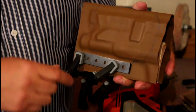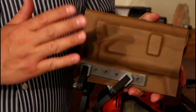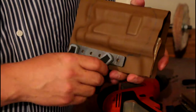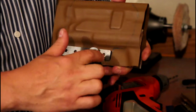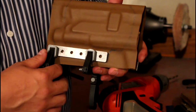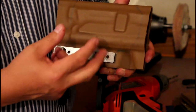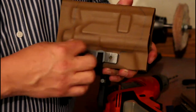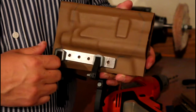We've got our drill guide in place with a half-inch block of wood clamped in there from making my pattern for the tension points. I'm only putting screws and holes every inch and a half, so there'll be one here, here, and here — three tension points. After that I'll get my half-inch rubber spacers — actually two quarter-inch ones — in those three spots. Then I have a pattern drawn on here and I'll cut it out on the scroll saw.